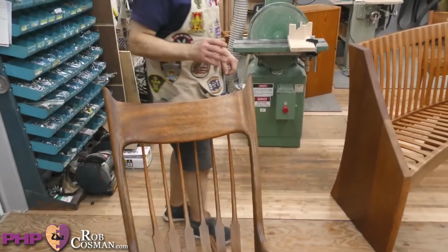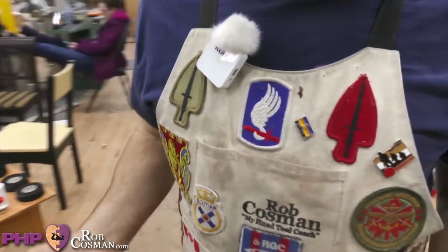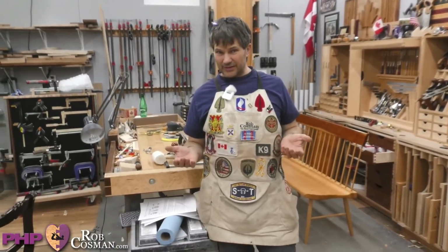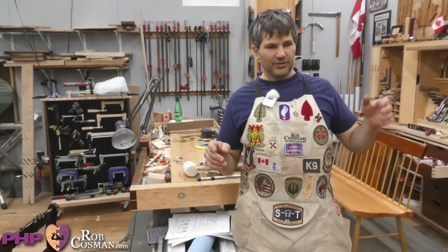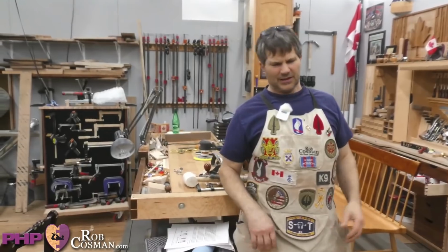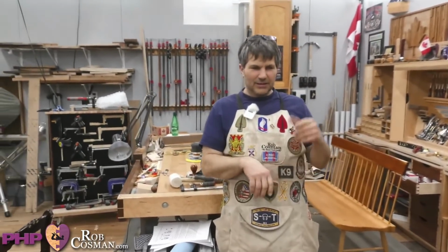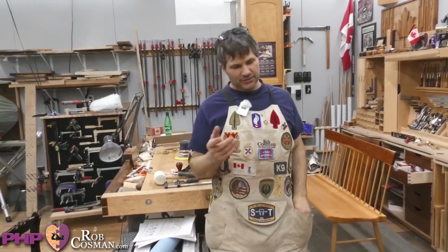Although I've been very surprised in my life by the performance of yellow or white glue that people just assume is the greatest thing. I've had it fail. I know Titebond 2 will lose 75% of its strength at 120 degrees Fahrenheit. I used it on a bent lamination piece of furniture, and sitting in a gallery showroom behind glass on the sunny side of the street, the thing just started breaking apart. What is going on? I came home and I had a piece left over. It was three-quarter inch pieces of ash bent around, and not a very tight radius. Put it in my mother's oven at 120 degrees, pop. It failed. I contacted Franklin and asked them, and sure enough, that was the problem.